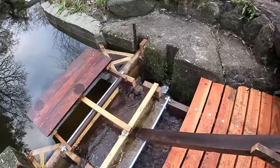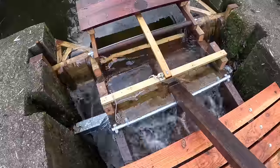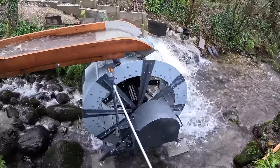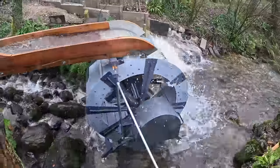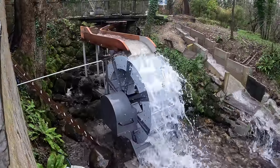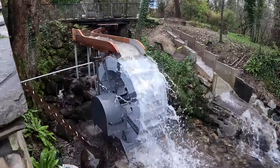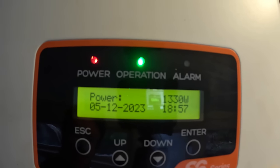Let's go full flow — why not. We're at full flow rate now, and you can see the speed is much closer to what we wanted. The buckets are about two-thirds full with some splashing, but as a percentage of total flow it's maybe five percent — quite good. It's still settling in but we're up to 1350 to 1370 watts. I'm hoping for 1500 — that's the minimum target — and it's looking like it's doable, which is a big relief.